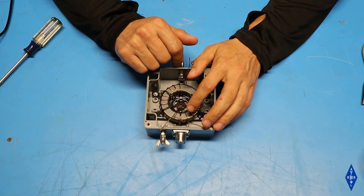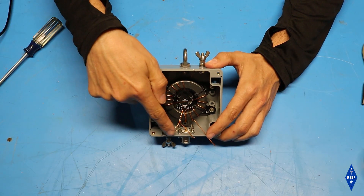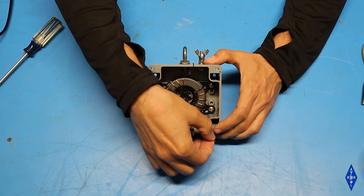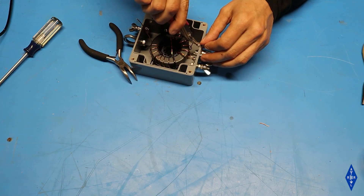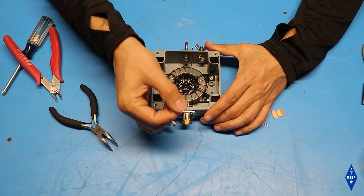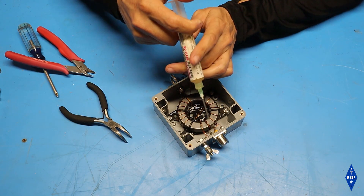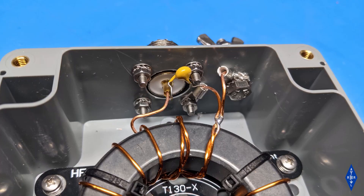Now that everything's installed it's time to start soldering some wires. I'll get the wires bent and trimmed to length so they can fit in their respective ring terminals. Working on the SO239 side of the box, I'm going to take the two wires that are soldered together and insert one into the ring terminal for the counterpoise and the other into the ring terminal connected to the SO239 connector. The free wire by itself is going to go into the center pin of the SO239. After trimming the wires to length it's necessary to scrape the enamel coating off the ends so they can be properly soldered into the ring terminals. I'm also going to install a small capacitor — one leg goes to the center pin of the SO239 and the other goes to the ring terminal tied to the mounting screw of the SO239. While I wait for the soldering iron to heat up I'll put a little flux in the ring terminals to help get everything soldered. Here are a few close-up shots of the finished project.